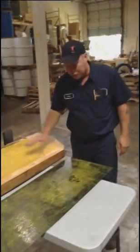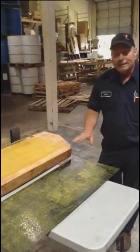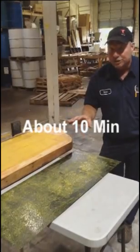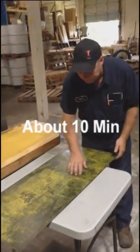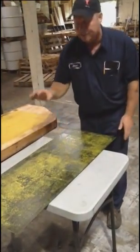Okay, now we've got both surfaces coated generously with the Ballz wall adhesive. You're going to want to let this set up to the touch, where you can touch it with your fingers and not pull the adhesive off of the kickback plate. Okay, now we've let our adhesive set up. I can touch it, my fingers will stick to it, and not lift the adhesive off the panel.